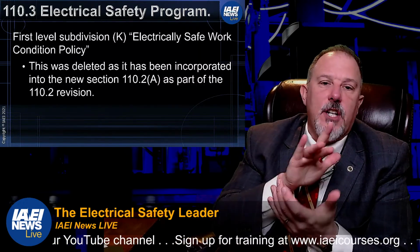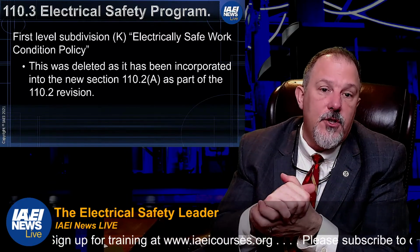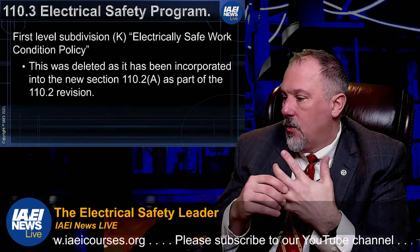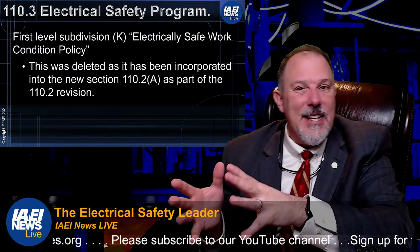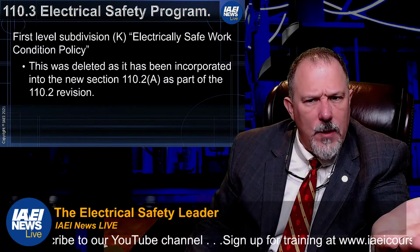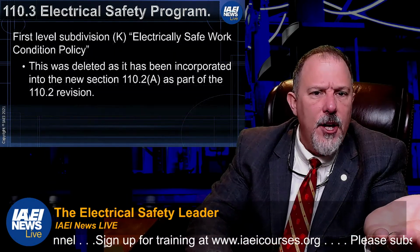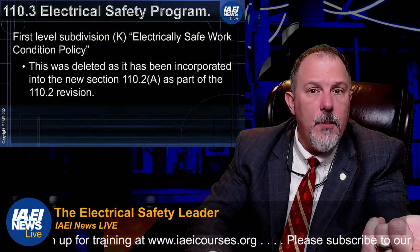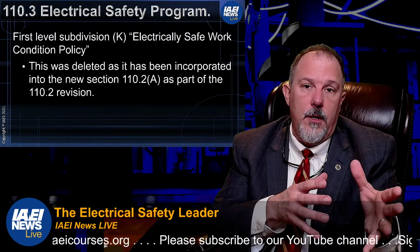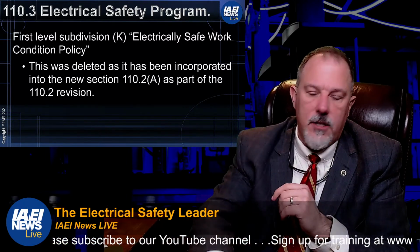All right, first level subdivision K, electrically safe work condition. Again, it was deleted and incorporated into the 110.2(A) as part of the 110. So that's your policy. So you see what they did? They took something that was in 110, which was not even 110.3. Remember, it was 110.5, I believe it was. Yeah, it used to be 110.5. You had electrically safe work condition policy buried down at 110.5. They moved it up to 110.2 in the parent text of that, saying you need to have a policy for establishing an electrically safe work condition.